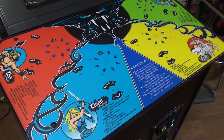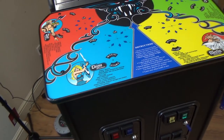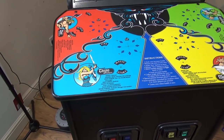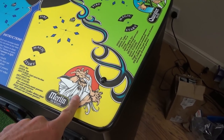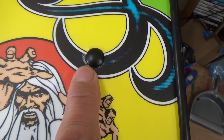And also I probably wouldn't use MDF wood because it's too soft, and banging this T-molding into the slot did damage it a few times and I had to repair it, and that annoyed me. But another little minor issue is the bolts. I over tightened them and they actually damaged the vinyl ever so slightly.